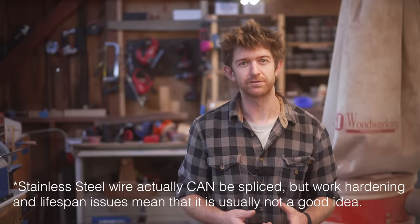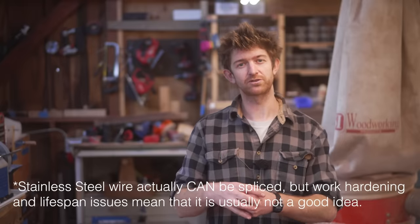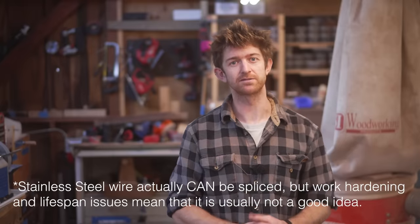You can get some galvanized steel, but not really in the quality or the sizes that are typically used on sailing vessels. So Tally-Ho's original rig would have been galvanized steel, and it would have been spliced at either end and probably served and parceled, but being so hard to get that material now, if we went with metal rigging, we probably would have had to go with stainless steel wire, which is now pretty much the norm for sailboats. Stainless steel wire doesn't really splice very well. That is, it's hard to make loops out of the wire and bring it back into itself. So you end up with a lot more hardware on the terminations of the wire and to attach it to the spars. So this wouldn't have been a very traditional or very fitting look for Tally-Ho.